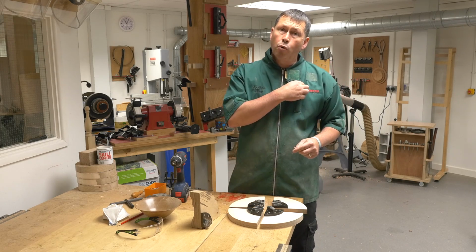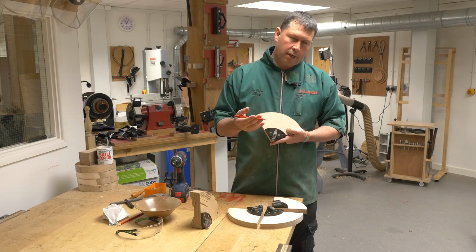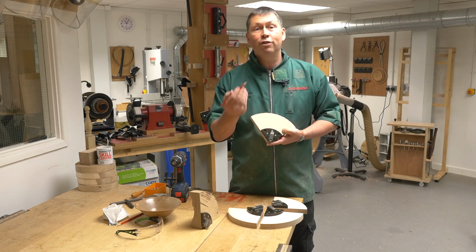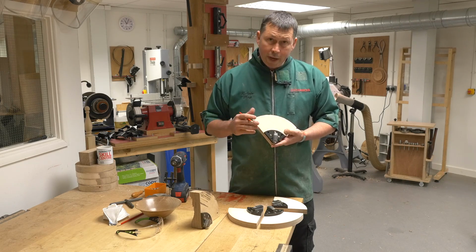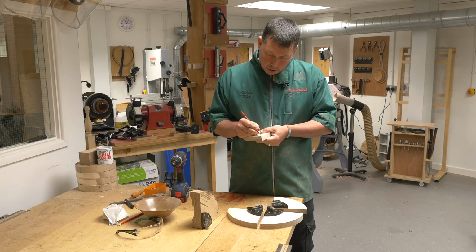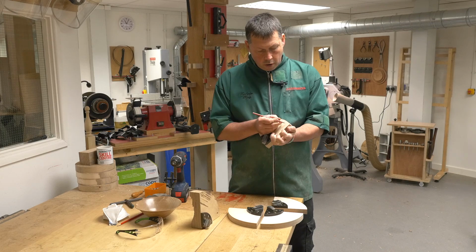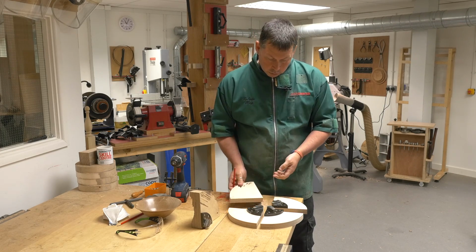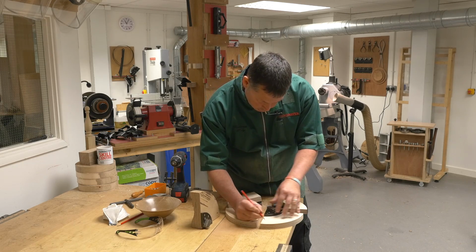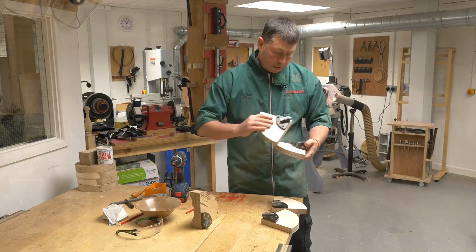One other little tip before we move to the lathe. We know that our jaws are all numbered. There's a sequence that the jaws have to go into. So we've got a mounting jaw numbered, we've actually got the plate jaw numbered, but it's on the side that is now covered up. What we'll do is number this top plate. So this is number 2 jaw, so we'll put a number 2 there, and just to avoid any confusion, another number 2 on there, and why not one on the back as well. And we'll do that to all of them. So we've got number 1 and number 3. There we are. Now we can move to the lathe and cut our recesses.